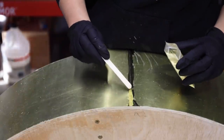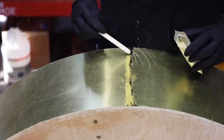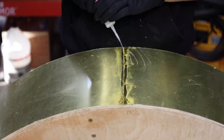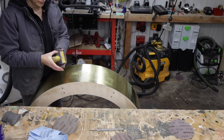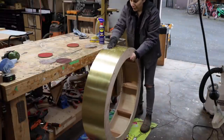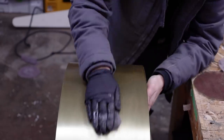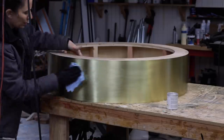Some of you may have asked yourselves about the seams — that was actually my biggest concern on this build, and I think my solution was a total fail, but I'll share it anyway. I thought maybe I could fill the seam with brass powder and super thin CA glue, then sand it down and it would blend. Spoiler alert — it didn't. But the sanding process for the brass is pretty simple. I wanted a brushed finish, so not super shiny — this type of finish is more kid-friendly when it comes to fingerprints and scratches. The trick is to move only in one direction. I started with 220 grit and found it cut better with WD-40 as lubricant, then went around the whole base with higher and higher grits up to about 600, and on the last pass used 4-0 steel wool and put a layer of paste wax to finish it — I like to use Renaissance Wax.